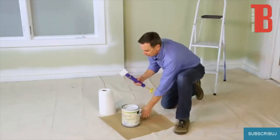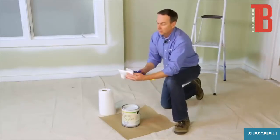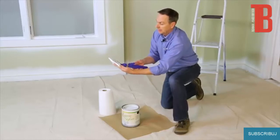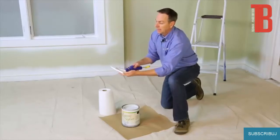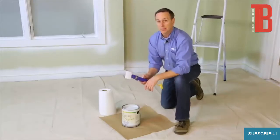There's a little air in here, so we'll want to purge that. We'll hold a rag in front of it and push the trigger — you'll hear that air come out — and now we're ready to go. You can see the paint is coming out, beginning to come out the holes.